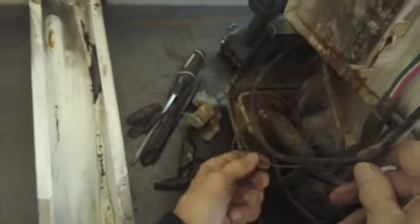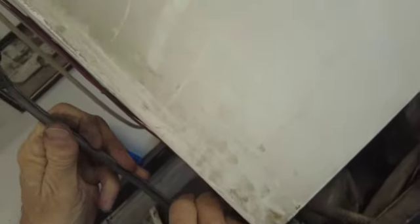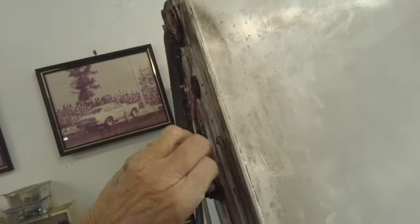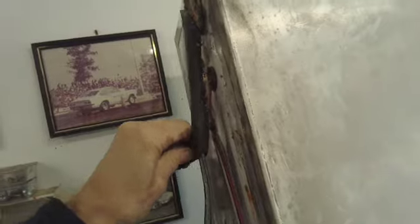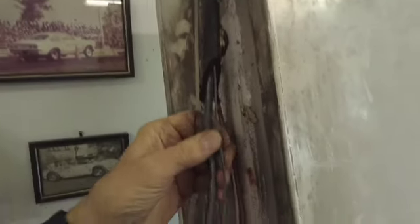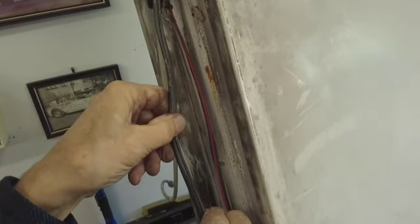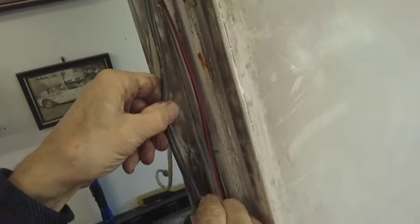So down here, that's it right there. It's soldered all the way up. And when the capillary tube becomes unconnected or disconnected from the suction line, you're going to get a problem with your sealed system performance, because wow, it's all the way up. We're not going to touch anything right now, because in the worst case scenario we might have to repair this and resolder it, but let's just see if there's a heat exchanger available.